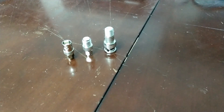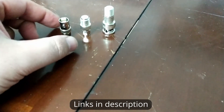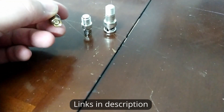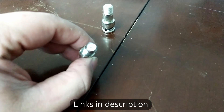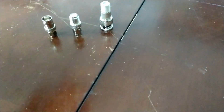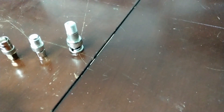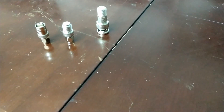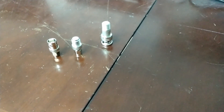These are some of the adapters I use to hook up the multicouplers to the SDRs and scanners. The first one is an SMA to BNC adapter — it takes a male BNC and converts it to a male SMA, allowing it to be plugged into any of the SDRs. Over here we have the same thing but for an F connector: it takes a male F connector and connects it to a male SMA adapter, again for hooking up to the SDRs. The last one is just an F connector to BNC adapter — if I want to connect F connector cables from the Electroline, it connects to a BNC, which can then be put into any of the scanners.